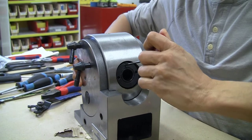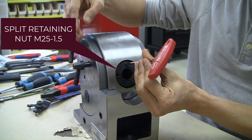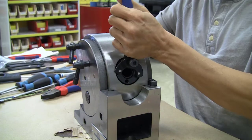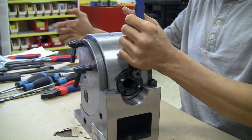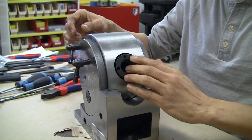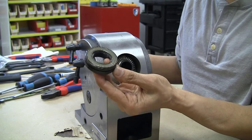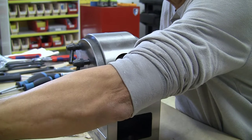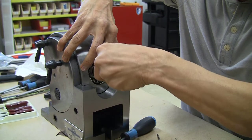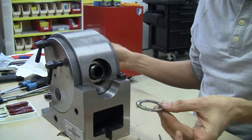This is the retaining nut that holds the whole spindle in place. It has what appears to be a set screw needing a 3mm wrench to keep it locked in place — it is just a cap screw. The spindle nut itself requires a spanner wrench; it was not torqued down too hard and was relatively easy to loosen up. Taking the nut out, you can see a washer and the needle bearing in the back. There is a fair amount of grease but it doesn't look ugly. I am using a pick to get the needle bearing out, and it came out nicely.